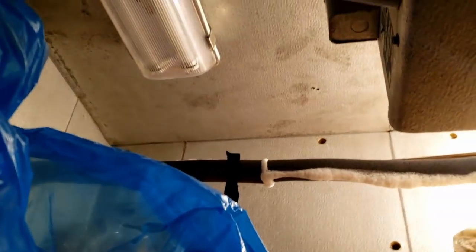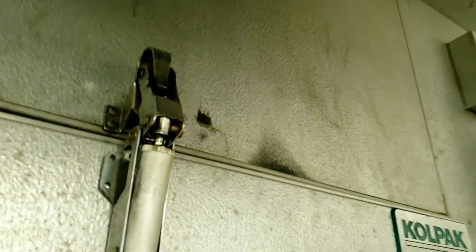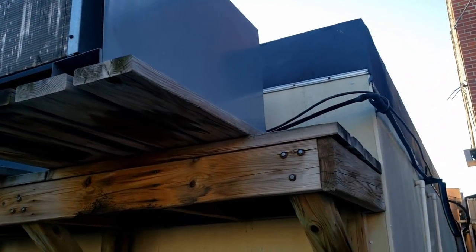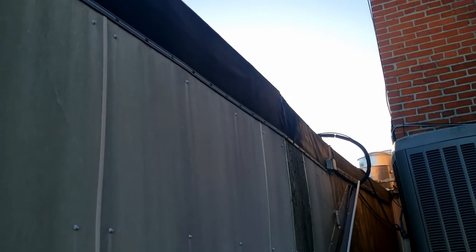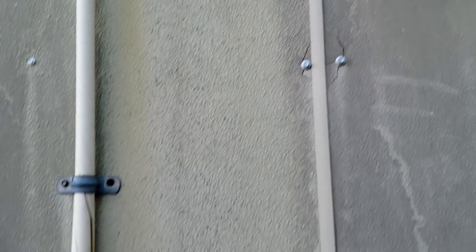The reason why that ice is on the line set there is it's not very thick, so I'm gonna go outside and see if there's anything coming out on the other side. This ain't very good either — look at this door closer, doesn't work. Somebody bent the heck out of it. I'll bend it up a little bit so it'll open up — really just needs a new one. So the freezers are out here along the cooler, kind of hanging there on the wall like normal.